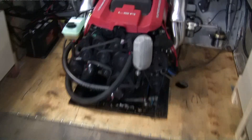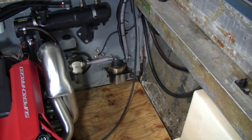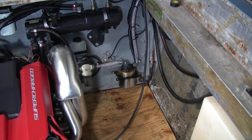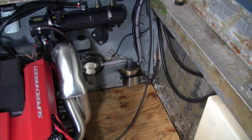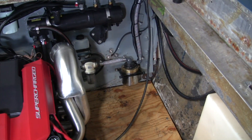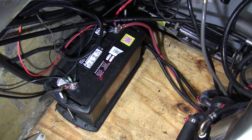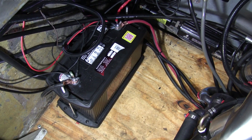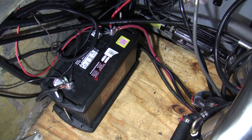With our engine installation, the majority of everything is done. We did leave quite a bit of slack in the hoses — you can see the fuel hoses over here. We left some slack in case we need to reroute some stuff after Convert-a-Boat gets the upholstery and other interior stuff done. We've got our Group 31 battery over here already hooked up. I did not install the battery shutoff switch yet because there's nothing really mounted to put it on, and they're going to redo the upholstery so it doesn't really make sense to put the battery switch in yet.